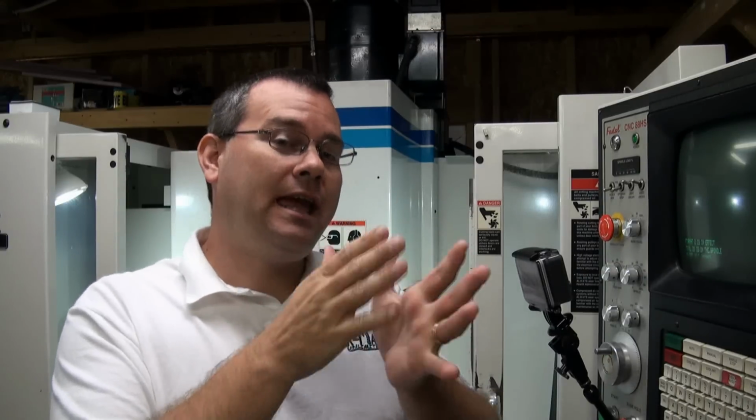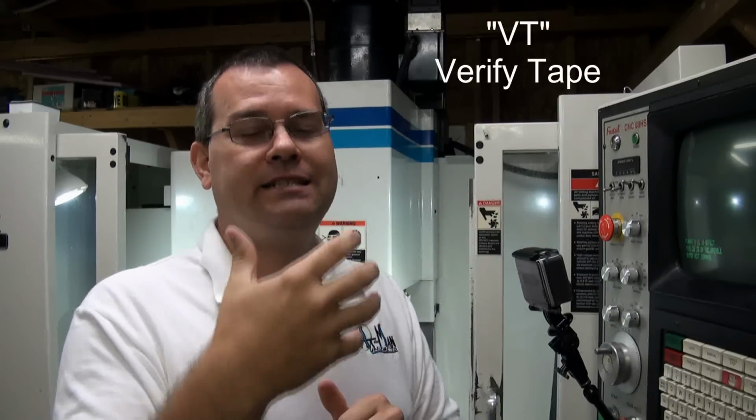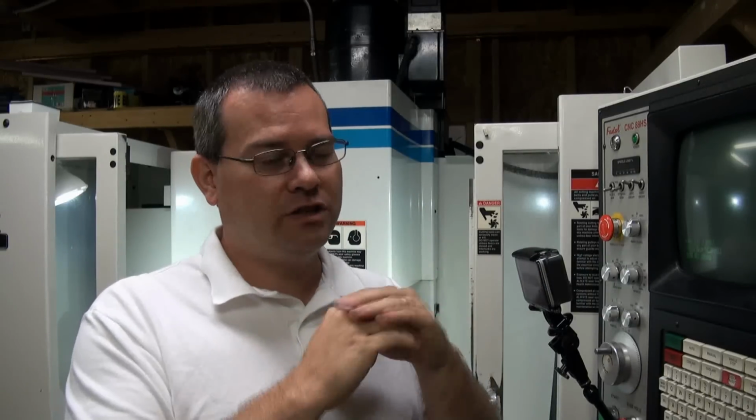Now, I highly advise you, after you do the TA, 1, that you do command VT, which is called verify tape. And then you can resend the exact same program, and it will tell you if the program is verified. Now, I will say, I have had programs sent to the machine, and I haven't figured out why yet. I'm still working on that puzzle, where the program went into the machine just fine. There are no errors in the program. However, when you do the verify, it will not verify.